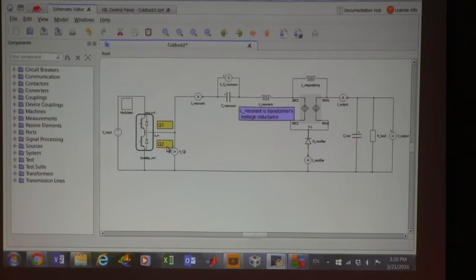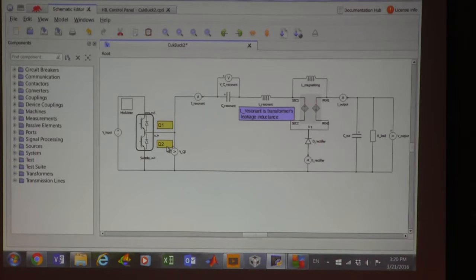When you change a load current, the load current is exciting the resonance and determining the peak resonant current. If I have a sudden step load from 10 amps to 100 amps, the resonant current on the output will just increase its sine wave magnitude 10 times next cycle — no more needing eight parallel buck converters to handle the step load change. The buck converter in itself is bad, and having eight of them is really bad.